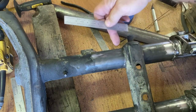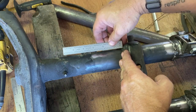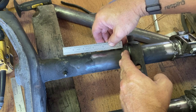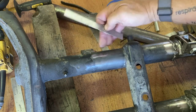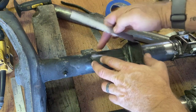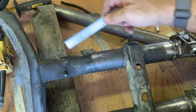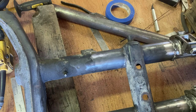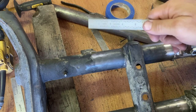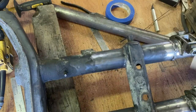Second thing: I need to know its distance from this bracket because as it gets moved this way, I need it to slide back. It is exactly two and seven-eighths on the 28 there — two and seven-eighths from here over. So when I cut out the two inches, slide this over, I measure back two and seven-eighths. I've got the line still scribed, move it over, clamp it in place, weld it in. It's only held in with like a quarter-inch tack here, here and here, and then on the bottom. I don't imagine it's something holding the body to the chassis. I'm going to make the same measurements on the other side and note these things on my notepad.